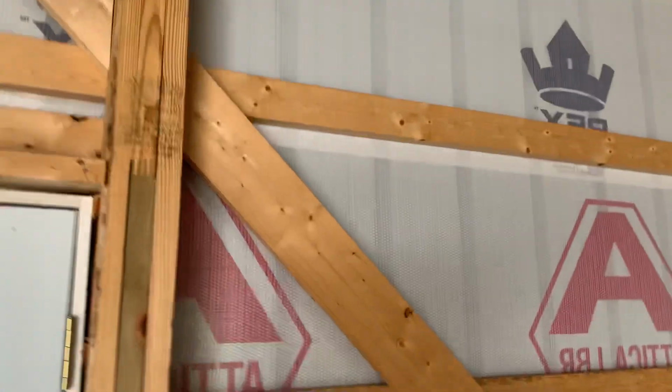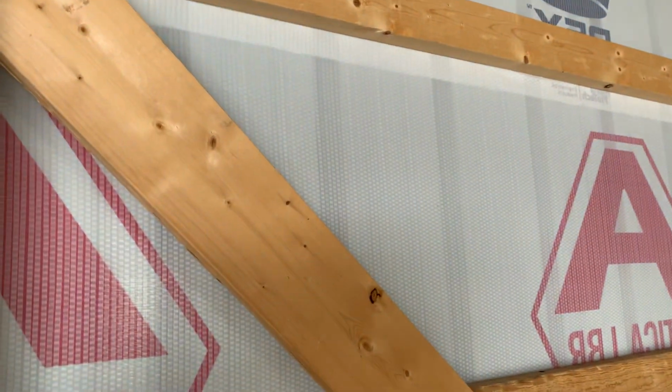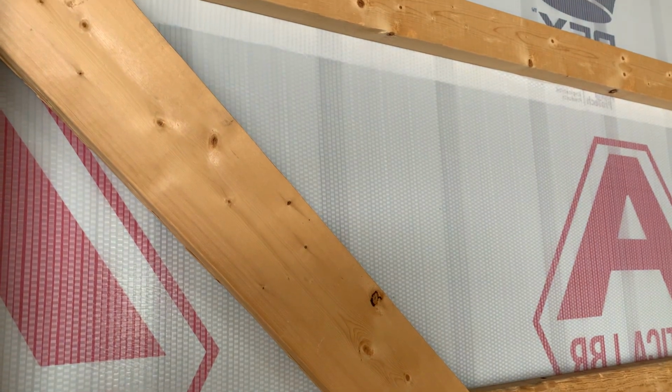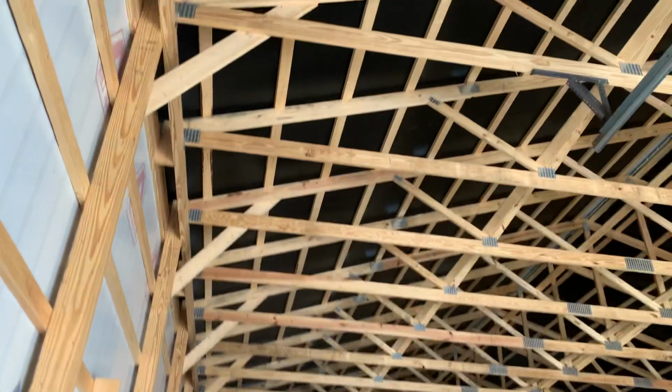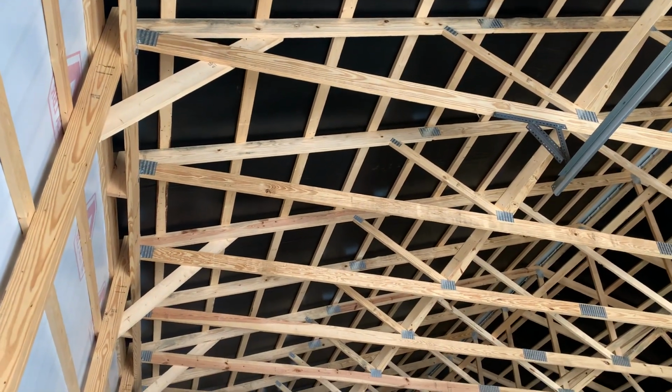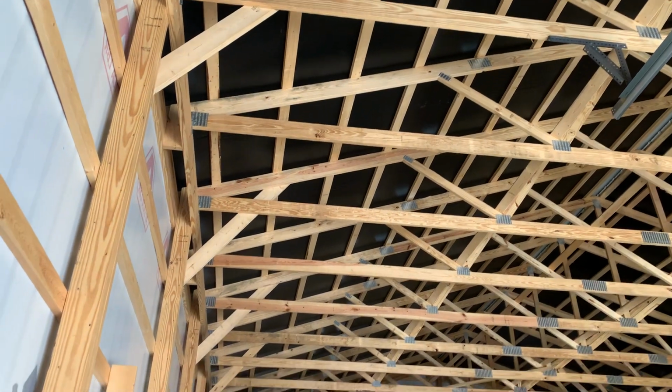All right, and you can see we went 2x4s, 2 foot on center. Some of these videos you may see that we use 2x6s, 30 inches apart. Again, depends on the zoning, the specs, the county. Again, we're always compliant with what the zoning regulations want us to do. All right, and then we use the vapor barrier. Some of these videos you've been seeing drip stop, but we use the vapor barrier on that. And again, always 4 foot on center truss spacing.